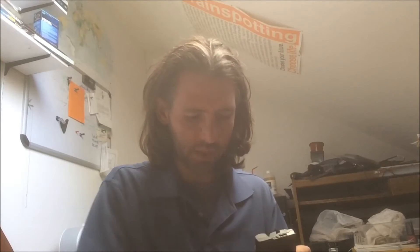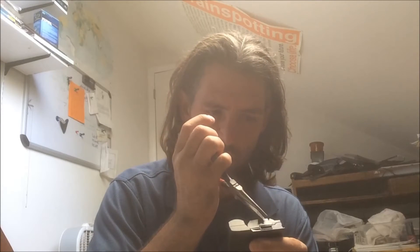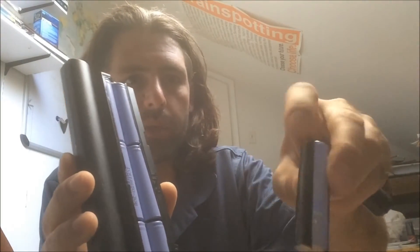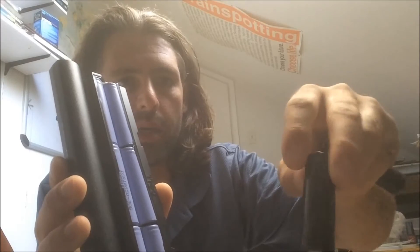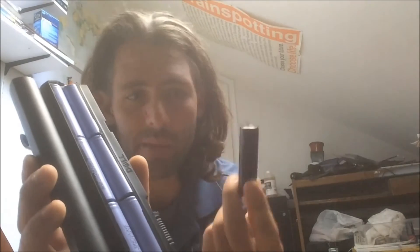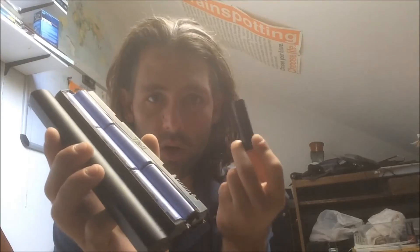I really don't want to work tools into these if I can avoid it because I don't want to scratch the cells. One thing you can do is if you do scratch the casing on the cell, just wrap it in duct tape — it's fine, it just needs to be covered with an insulator. These are some of the purple cells from stubborn Dell packs — I scratched the casings and I just wrapped them in duct tape. It's a lot tougher than the shrink wrapping they originally do them with. It doesn't damage the cell or mess up the chemistry inside.